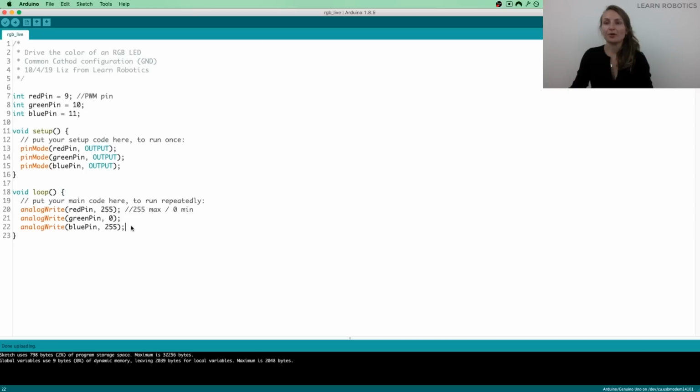If you wanted to make it flash, what you can do is you can keep the color on, and then you can shut it off. And so to do that, you just set it all to low. You just set all the pins to low. You can initialize them as low as well. But what I want to do now is I want to spend some time cleaning this up to make it quicker for you to actually generate these colors.